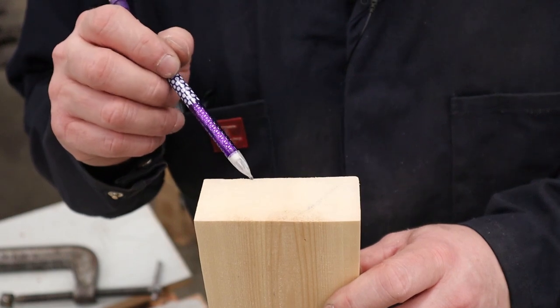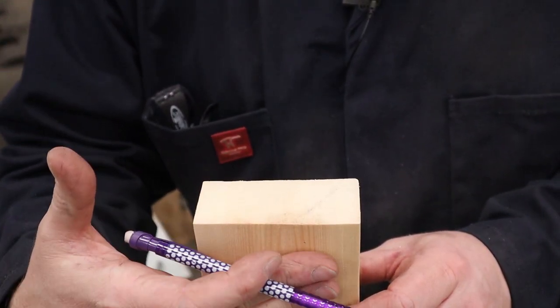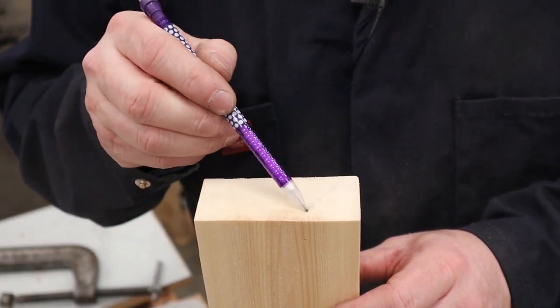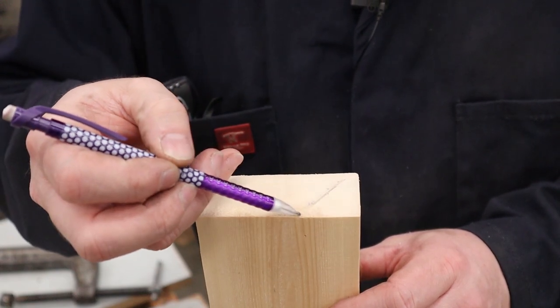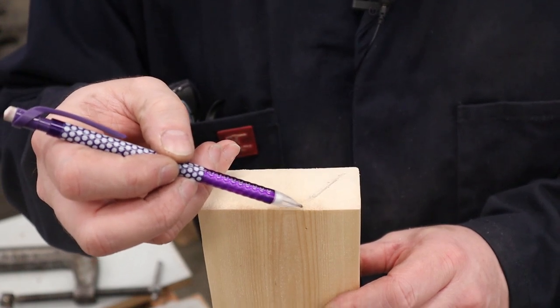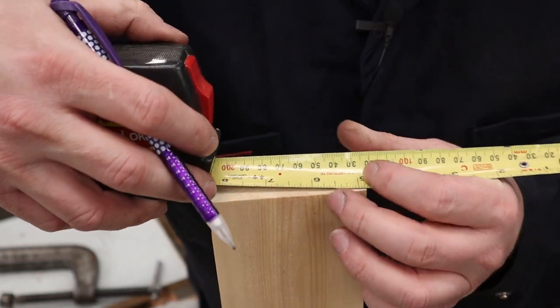Give it a clamp. On the end of one of your pieces, figure out the orientation — this face sits on top of the table saw, and this face sits against the fence, so we're going to be making roughly a 45 degree angle on the end. What we're going to do is measure accurately from the corner over about an inch and a sixteenth — no more than an inch and an eighth. I'll probably go closer to one and one sixteenth, so I'll use a tape measure and make a mark.